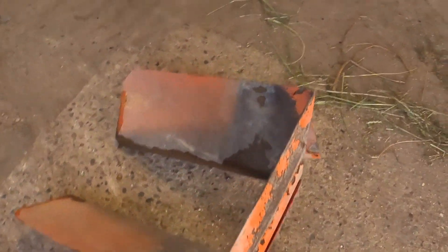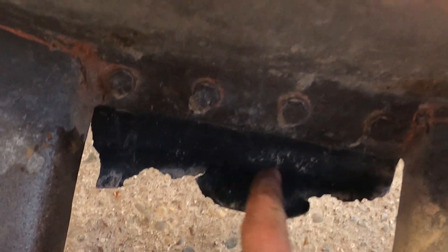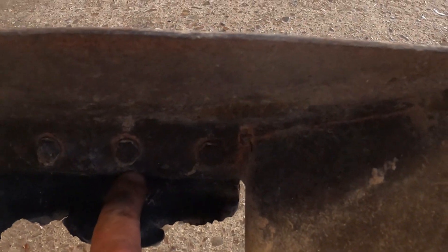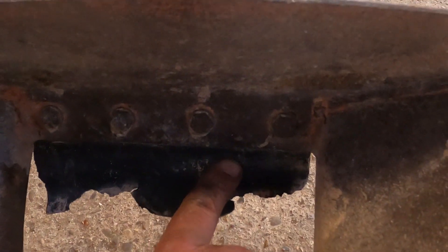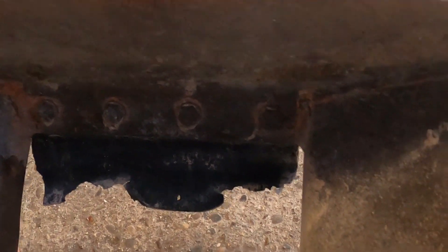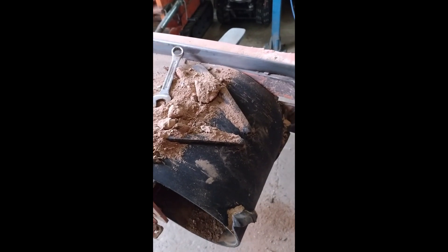The other repair I've just discovered is this edge here — it's a rubber flap that stops material dropping down behind the roller. I'm going to unbolt this, cut a new one in there, and then get the conveyor belt back together. The bearing is gone on this one, and so is this one — so that's another job. I'm going to get this existing conveyor belt off and fit the other one on.